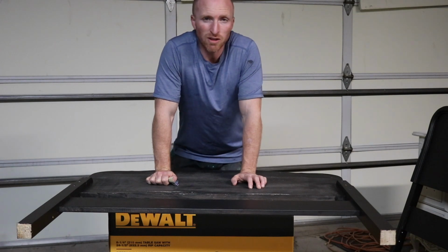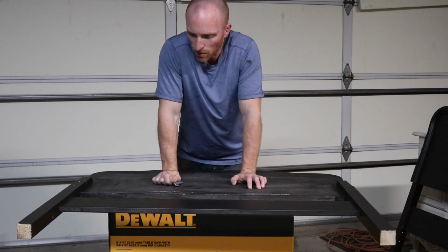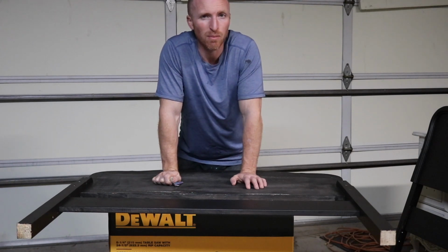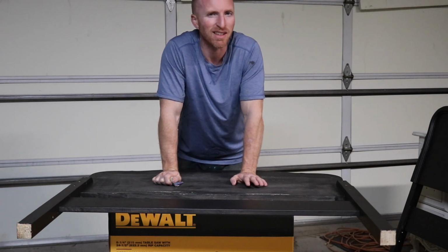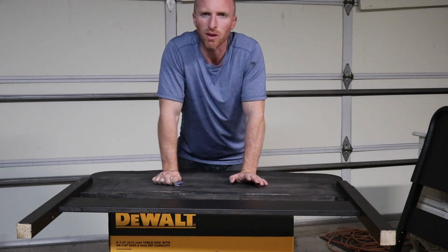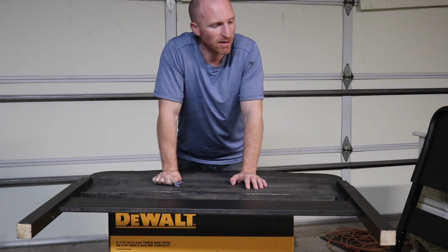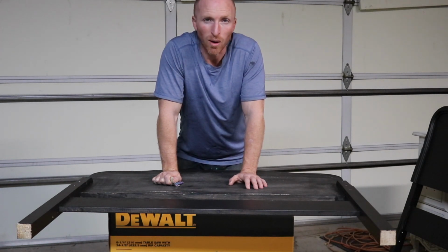Alright, we put 2 layers of paint on it, and now we're going to scuff it up with some old 80 grit sandpaper. Now this is definitely a step you could skip if you want that solid look, but here at Vintage Statements we do want that vintage feel with the scuff marks. So we're just going to go over it nice and easy and get some wear on it, and then we can start waxing this piece.